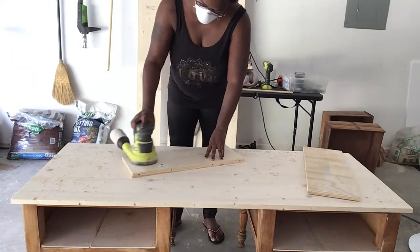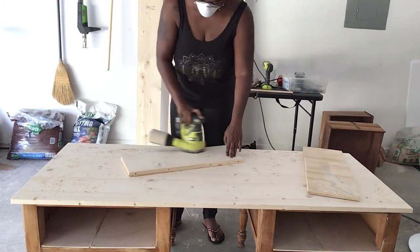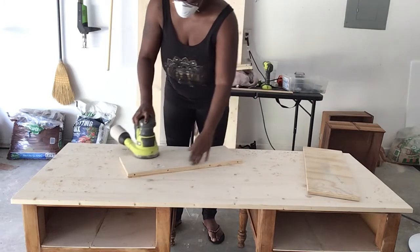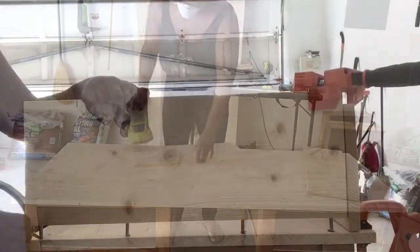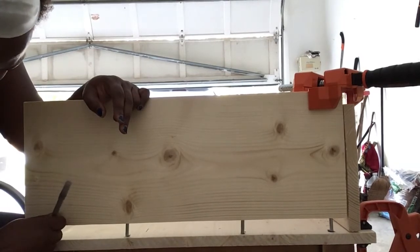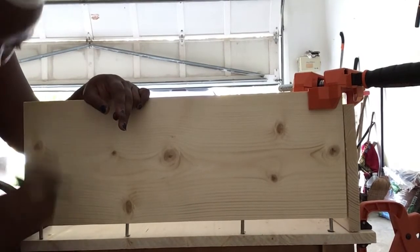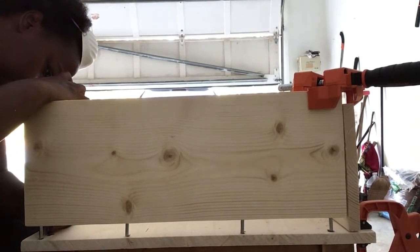Because I'm attaching from the top and the bottom, I need to drill dowel holes in both the top and bottom of all the support pieces as well as the base piece below. After I get all the dowel holes cut and everything cut down, I'm just giving it a light sanding to get everything smoothed down a bit. Then I'm marking off where I need to drill the holes in the base piece.